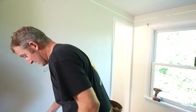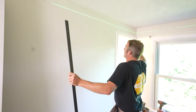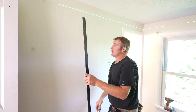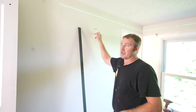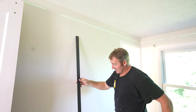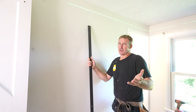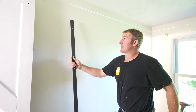The first thing you want to do is install the rail system. If this was a new construction job, I would have put blocking all the way across here so that no matter where I screwed my screws in, it would have had some wood blocking to get into. But in this situation this is a remodel job — I'm not going to tear open the whole wall and redo everything. Most kits do come with anchor systems, like a toggle bolt system for where you don't have framing. Hopefully we can get some framing somewhere along the line, but it's really hard to tell. The holes are spaced 17 and a half inches, so even on a regular traditional framing job these things aren't going to line up, so you're going to end up using toggle bolts. If you were doing new construction, or if you were removing this wall for some reason, definitely put some blocking behind — that's definitely the better way to go.